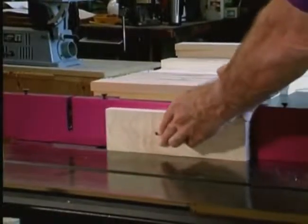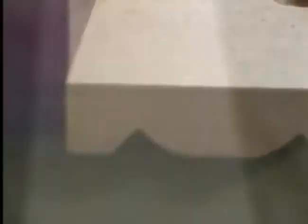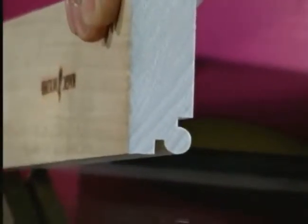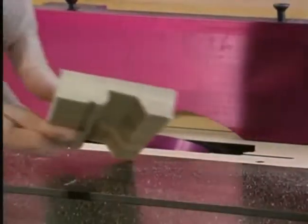The Magic Molder is the only carbide-tipped molder head for table or radial arm saws. Carbide-tipped cutting edges allow you to shape MDF for paint-grade molding and casing, not to mention any and all natural woods. You can shape pencil molds, also known as bead molding, and make double cuts that are always equal. The anti-kickback chip limiter design produces extremely smooth cuts, and the balanced heads and plugs eliminate chatter marks.